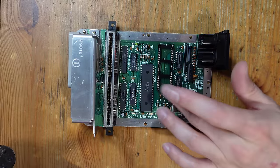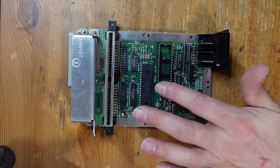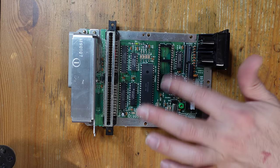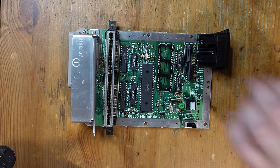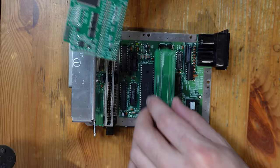Okay, so the PPU has been removed and I didn't have any issues with the vias. All of them are intact and nothing got lifted or damaged in any sort of way. And then from there, I went ahead and installed this precision pin socket that comes with the kit. So now what we've got to do is assemble the stack of the NESRGB and this adapter board.